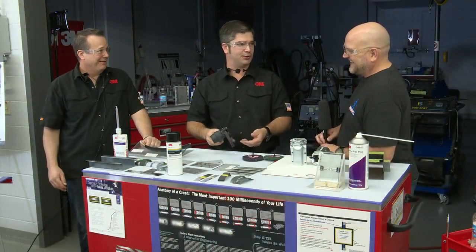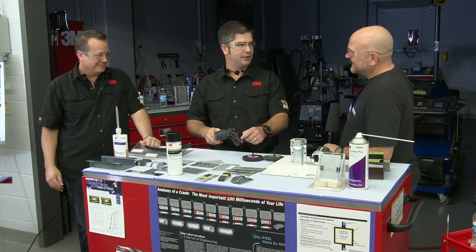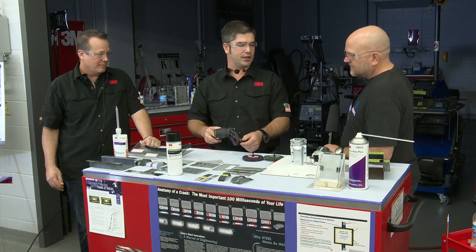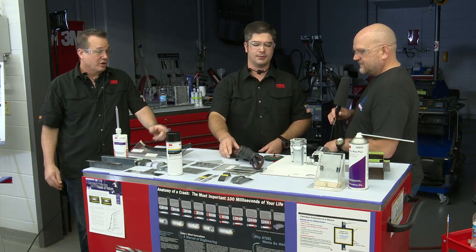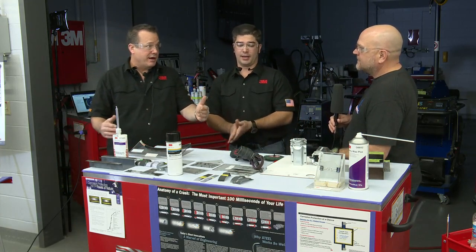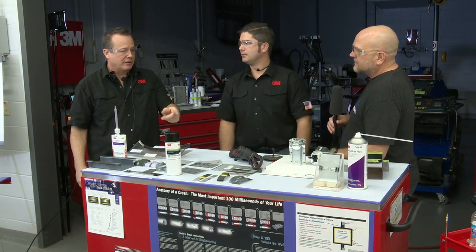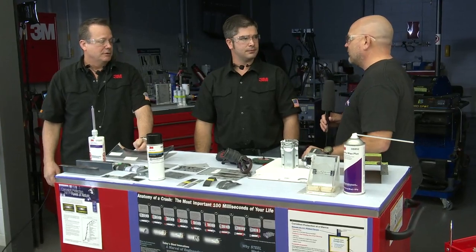And they say it's a crappy product, junk tool, the belts suck. But maybe you just need to realign that. It comes aligned from the factory when it's made, but maybe you need to readjust it so that you're getting proper wear on your wheel on the front too. It's always a good idea to watch the wear on your belt, kind of like a tire. When it's not wearing properly, you've got some kind of an issue. That little spring-loaded screw will adjust that. Equipment maintenance is always important. I don't think it can be overlooked.